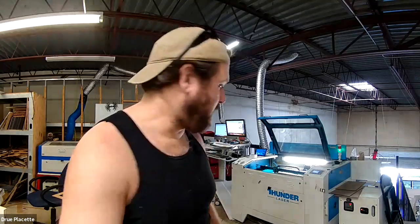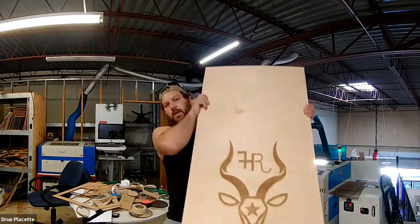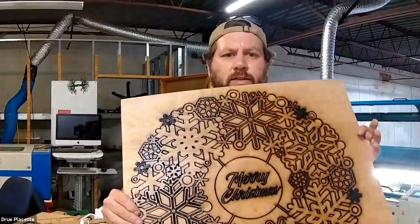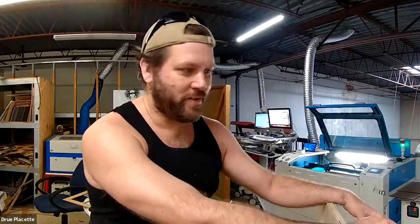Yeah, that'll be perfect. Instead of people trying to engrave, especially with 7 watts like this, it'd take quite a bit. What I think would be really cool is if we start learning how to do scoring. They can do really nice stuff, and it comes out really well. I'll play with a lot of scoring because I try to tell my guys, when you're doing large engraving, scoring is like 95% faster than engraving. And it'll put way less wear on the diodes.